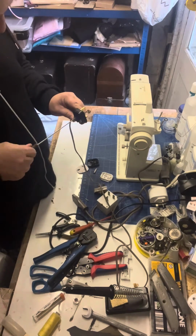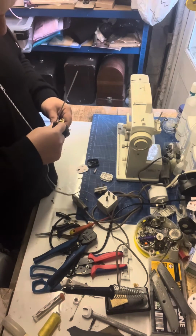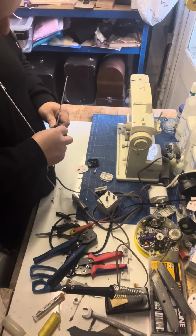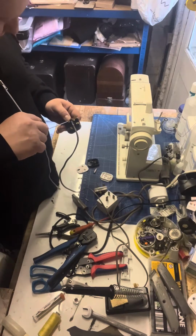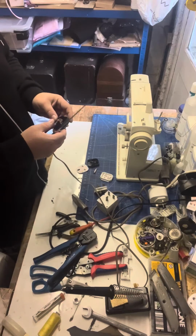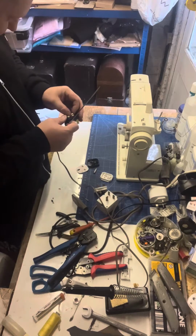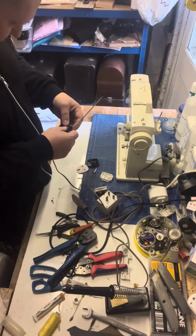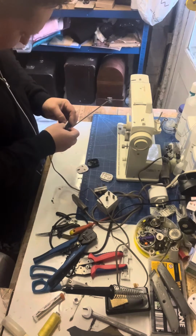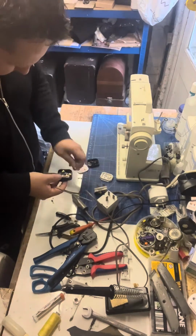I know that the back boxes for sockets, there's some now that are Wago style connectors. They're a bit more expensive, but they speed up installation for an electrician. So I'll do some other bits and bobs for people, and yeah, they're becoming a firm favourite. So, plug essentially wired. Just pop that fuse in, snapped into place.